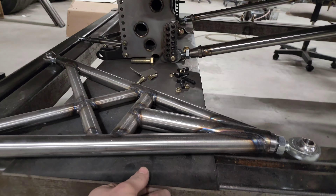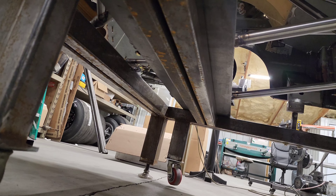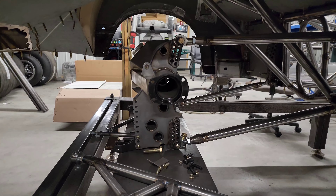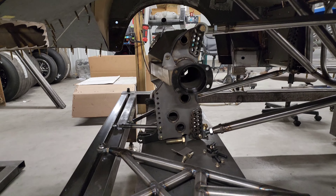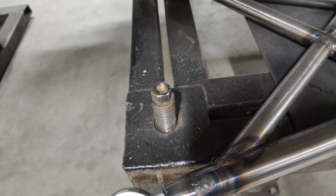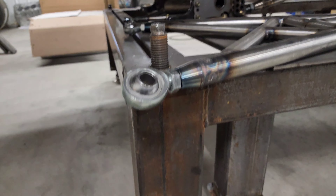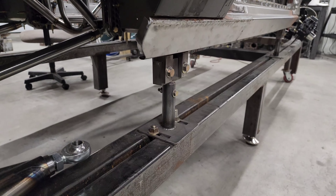Back underneath this plate — which isn't welded on, just sitting here — we have another cross member going right here and one on the back. We have this one for the rear ends so we can raise and lower them; we have some stands that set that height, which makes it really easy when you're mocking up and centering the rear end. These are just 4x4 pieces that we plated the top of and welded nuts on the inside, and then we have these feet that swivel on a ball — you can just put an impact on this, screw it down, and that's how we level the table.